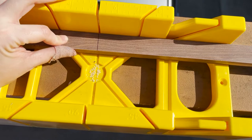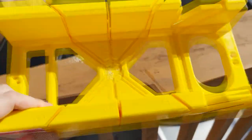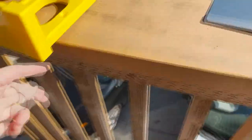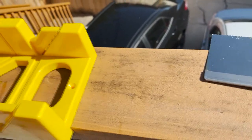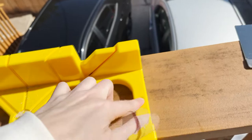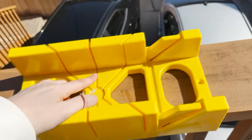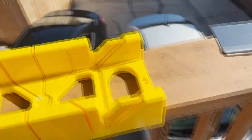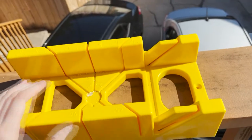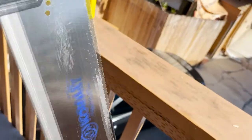First, take the measurements of the sofa length and then cut the boards of one of the picture ledges to size. When using a miter box, if you have a newer one it has a little lip — line that up at the edge of your table and it forces the box down. You can also drill it into your tabletop. Line up what you're cutting and saw back and forth. I got a cheap miter box but a nicer saw, which I thought would be more important.